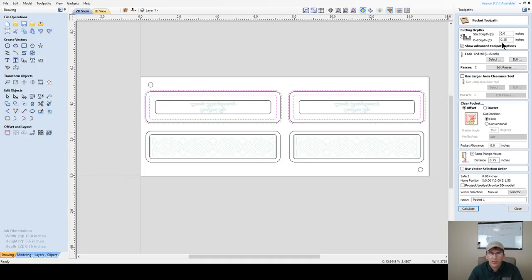If you go deeper and stuff, and if you feel that a quarter of an inch, your lid's not getting that much of a bite on the base, then go a little deeper. Go 3/8. Using a quarter inch end mill, I'm going to use a ramp, and this is going to be my box base.